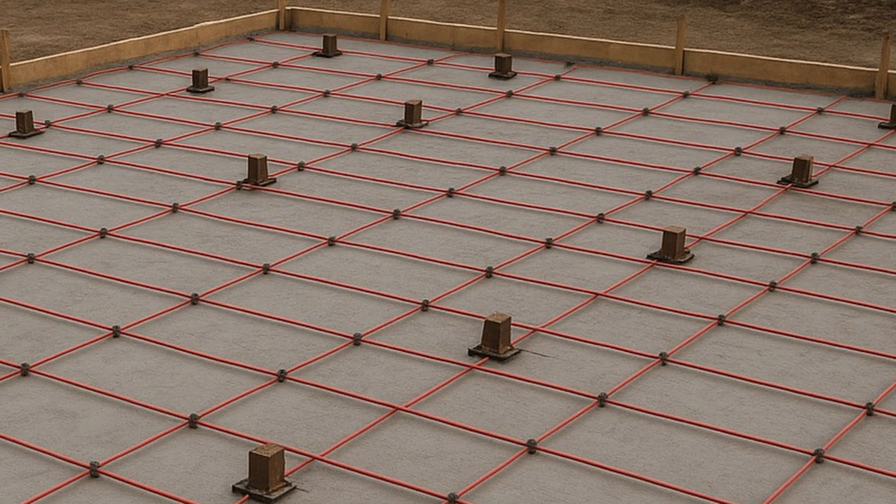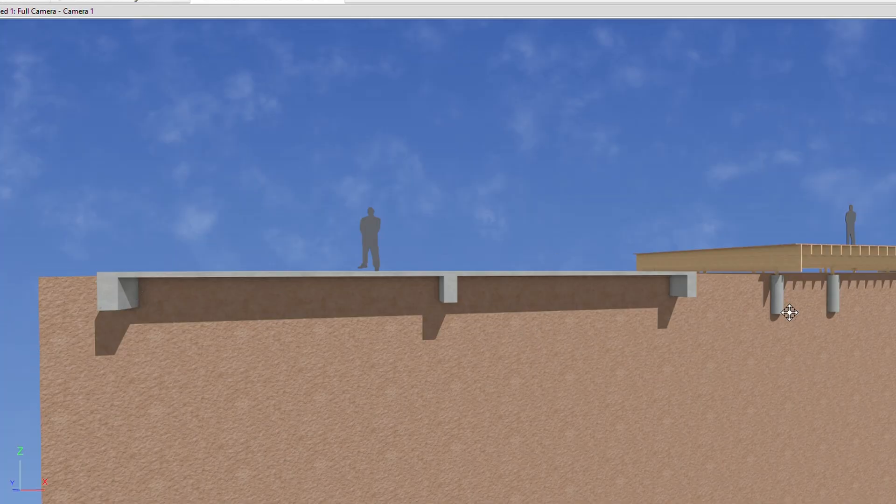Or you do it even cheaper — throw some rebar down, put concrete over it, and tighten the rebar up. You do a post-tension slab, and that whole thing floats on top of the expansive soil. That's the cheapest option. In my opinion, it's not very high performance. Having something move is not always the greatest solution, especially with post-tension. I would rather have it not move, and you can accomplish that a few different ways or a combination of them.